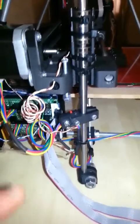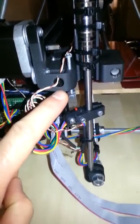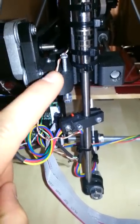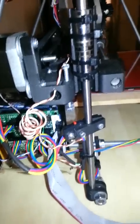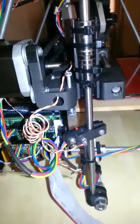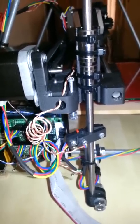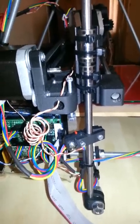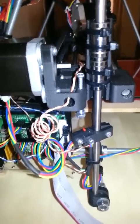So this is more precise. What I did here, I have a screw that goes through with a couple of nuts for a flat end that makes the contact. So by turning that screw, you can make the smallest possible adjustments to your end stop for Z. You can tweak that by a fraction of a tenth of a millimeter just by barely turning the screw. It makes it very quick and easy to get your initial Z-height end stop set.